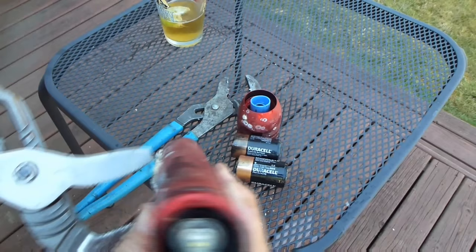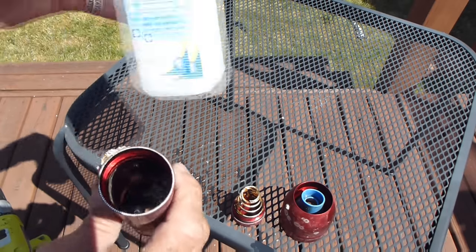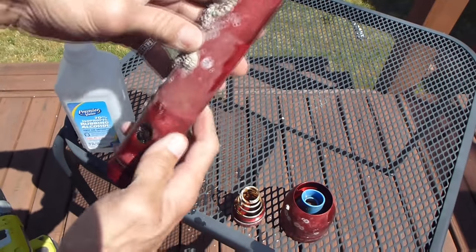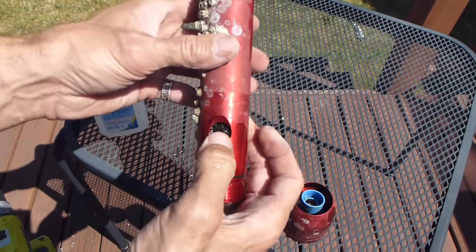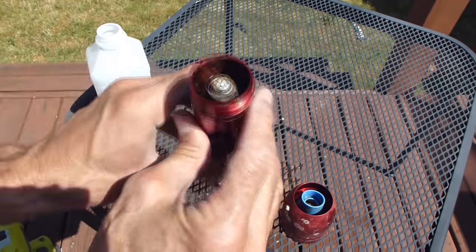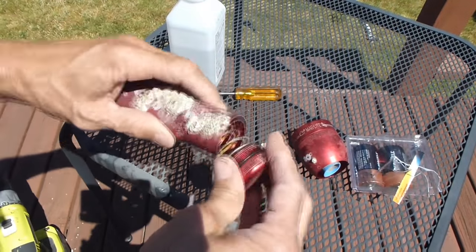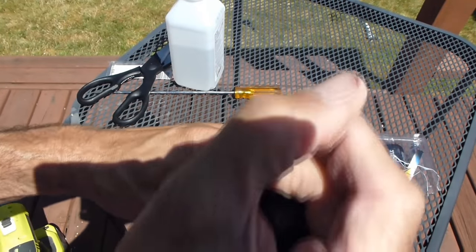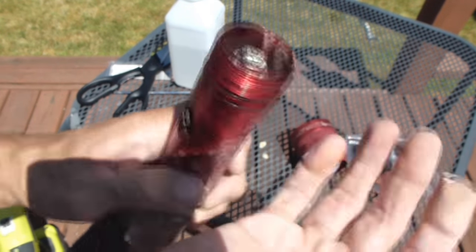I'll clean it up anyway. Fortunately on this one, the button switch was moving — it wasn't frozen like the black one — so I figured I'd take a chance and give it a little effort. Rinse it with rubbing alcohol. The video is only showing one rinse; I did a couple of rinses prior. Rubbing alcohol mixes with the moisture and the electronics, and when it evaporates it takes it all with it — so that sort of cleans things out. Afterwards I let it dry for a few hours and then decided to go ahead and load it up with some fresh batteries just to see what happens. It was a Hail Mary — I just thought, what the heck, let's see what this thing does.